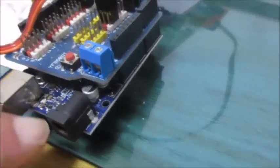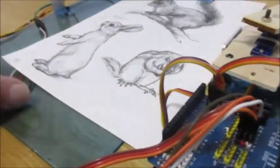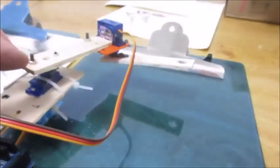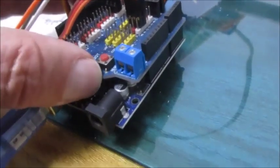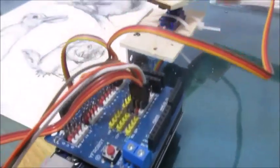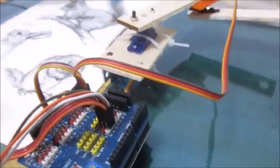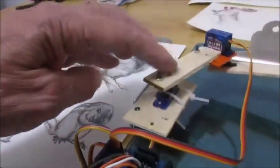I run them into an Arduino Uno with a shield, which makes it a lot easier to plug servos and sensors in. Everything is running on the potentiometers, and the servos are running off the power that goes into the Arduino Uno. Normally I would have external power for the servos, but it provides enough amperage to drive both servos. The program is very small — only 20 to 30 lines — and very simple. The computer is really just translating the motion from the potentiometer into the servo directly.